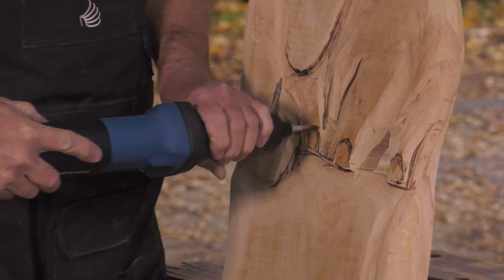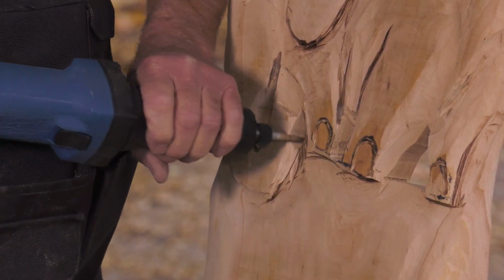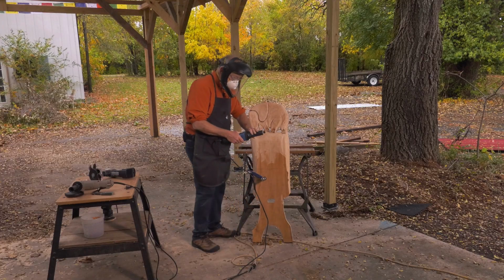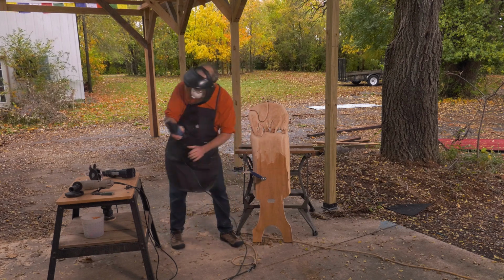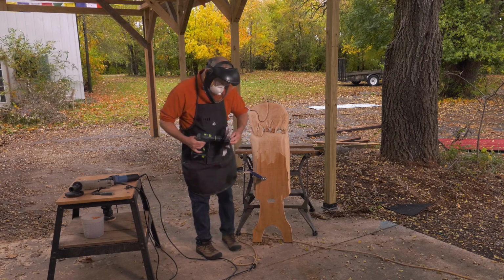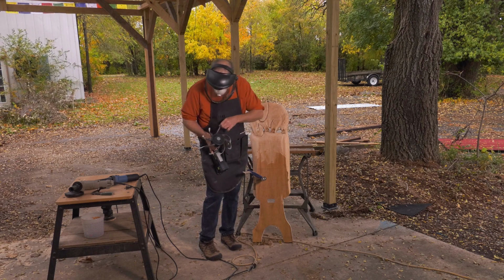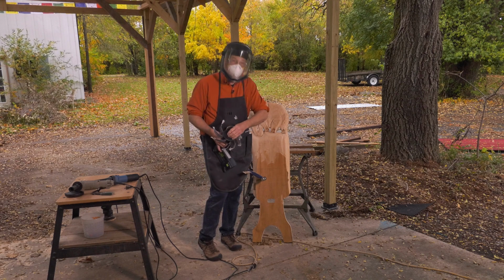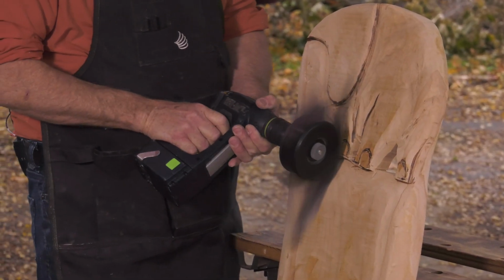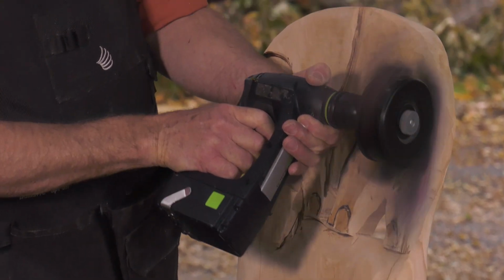And then, once I'm through with this, because it really can go to town and get in there nice and deep, then what I can do to save time, turn that off, and I'm going to show you, this is called a Sandoflex. I only use 80 grit, and whenever you need more grit, you just release that, and you pull more out like that. It's coiled up on the inside. Tighten that back up because it will keep coming out. And now what you can do, bracing your arms to your body, you can really go to town with this to feather in the detail.